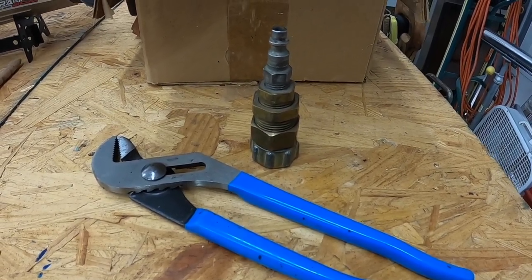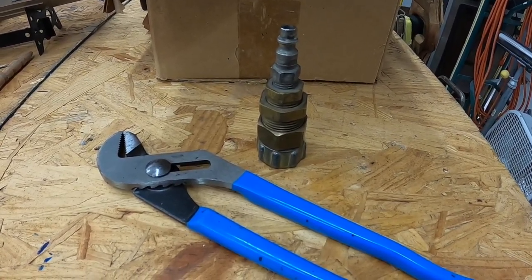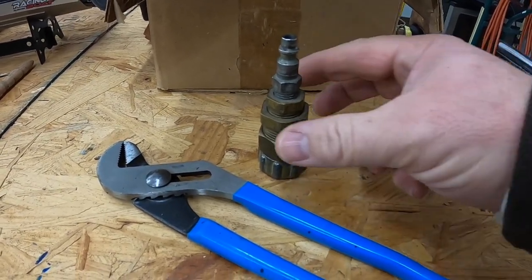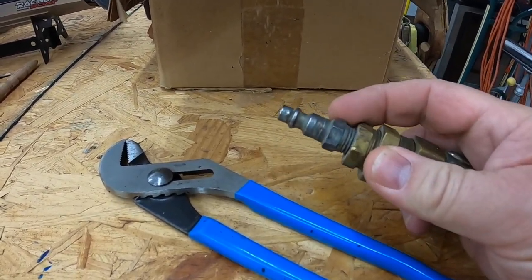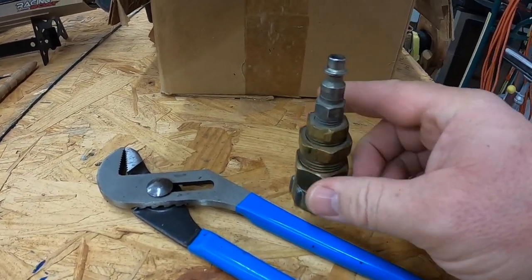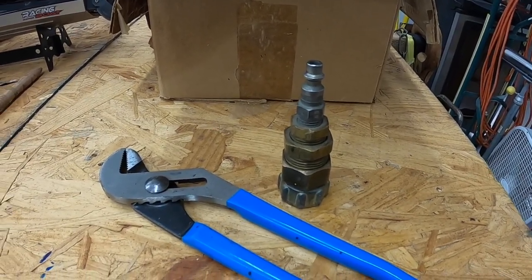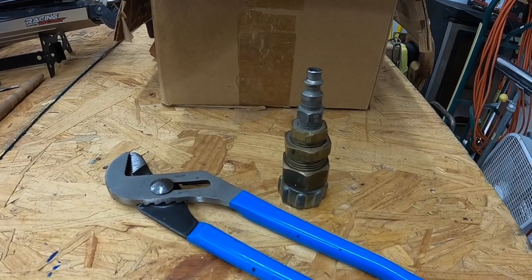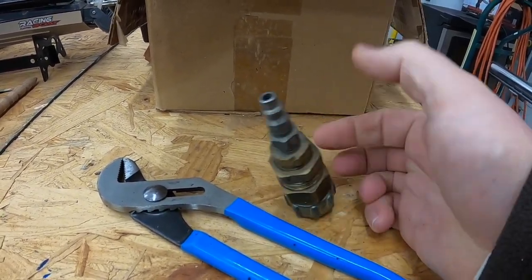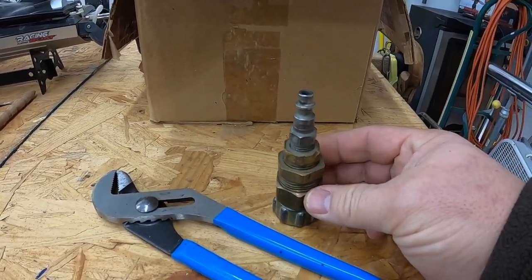So I went down to my local hardware store, the Hayesville True Value Hardware, and I made this adapter to go from a 1/4 inch air nozzle to a garden hose, because in my sprinkler system I've got just a boiler valve out there. I'll show you here in a minute, and that's what this garden hose end plugs into, and then I can hook up my air hose to this top part, and it just pumps air through the system instead of water,